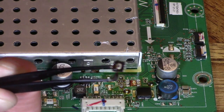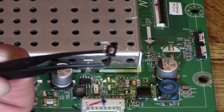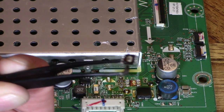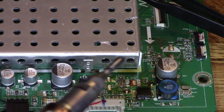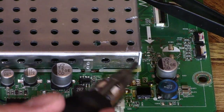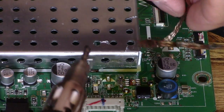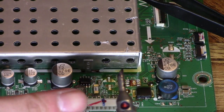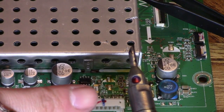You're going to destroy the traces. So just be patient — heat it up and let it move a little bit. You'll see it float a little bit around on the solder pads and then you can remove it. I'm now going to remove the rest of the solder off the solder pads. And you want to make sure that heat vent is blowing away from the board.